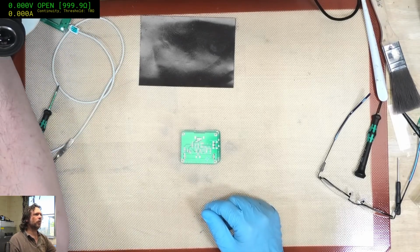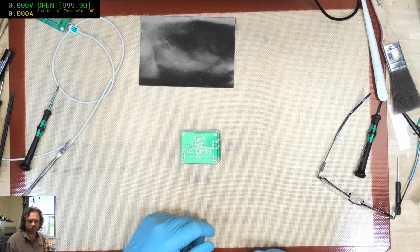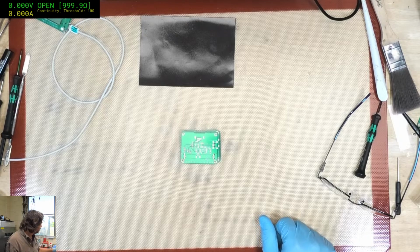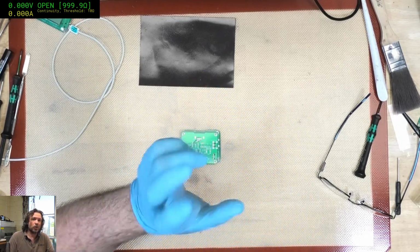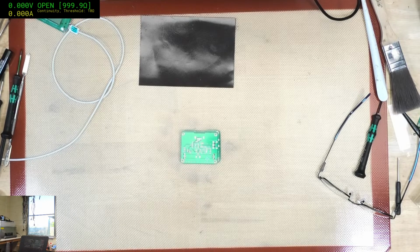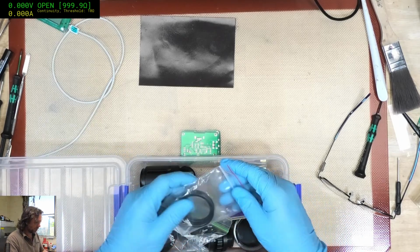I have protectors on my camera lenses. Yes. Well, you mean just like UV filter lenses from Heiko, or whatever the brand is. But yeah, I always have those. Like, if you have a microscope and you are not using a Barlow, still go and put one of those 48mm or whatever protector lenses on it. You will regret it if you do not, because you'll end up with flux and splutter, all sorts of stuff on the underside of your objectives, and trying to clean that is not fun at all. Definitely something you'll regret.